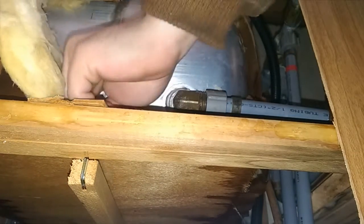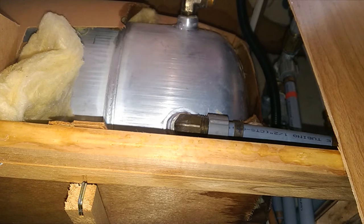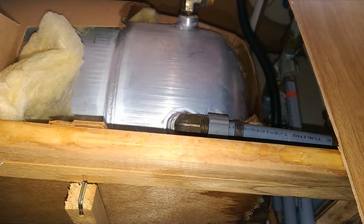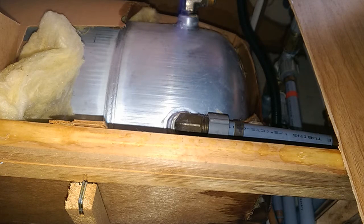So here's what I did — I scuffed up the aluminum and then I cleaned it. I used brake cleaner, then dried it all off real nice. I do recommend if you use brake cleaner to clean anything — it's one of my personal favorites — be aware it is extremely flammable, so make sure it's all cleaned up real nice before applying heat, as it'll get a nice little flame.